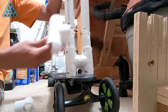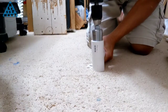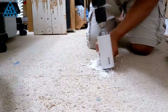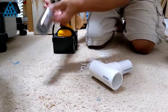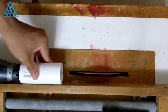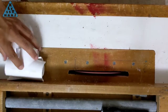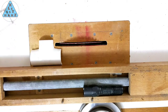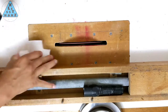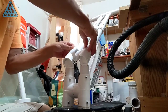I'm going to use a tee cut in half to make a symmetrical stopper that will mount to the top of the handlebar fold. It's hard to describe exactly how it will look, but it will be easier once I cut everything to size. I have to bore the tee so it will fit as flat as possible over the handlebar and folding joint. This reamer I made in another video will make quick work of this using my 18V 8000mAh refurbished Dewalt, which after 3 months is finally running out of battery charge. I'll cut this single tee in half, which will create the two pieces I need to mount over both sides of the handlebar — my cut will be slightly off center but that should still be okay.